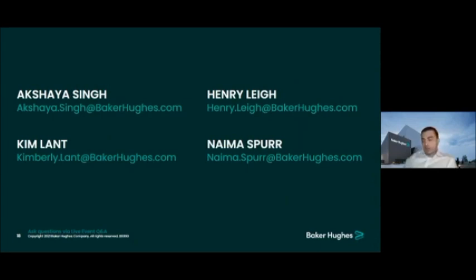Thank you, Naima. So again, like we said, this is a young product. What we have tested in the field and in the lab, with the different repeated cycles, there's no way to directly correlate that to what it will do to your field, because every reservoir is different, your production velocities are different, and the longevity of a water shutoff can only be proven while we continue to monitor the production. What we pumped in the first well, we're still seeing that AquaCUT is still very much present and still very much doing its job.